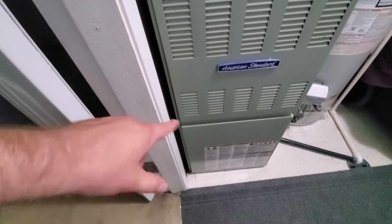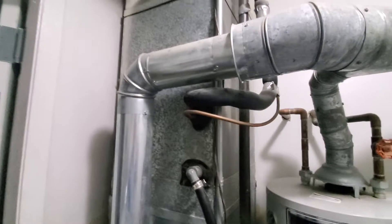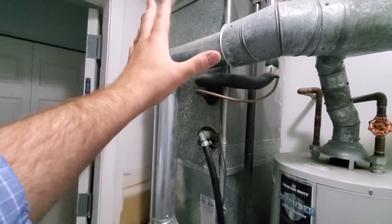We'll actually need to create a small sleeve to connect to the side of that. Over here there is no drip leg, and we do need to change the gas valve. We are putting in a large fan power — I believe that's going to have to go on the face here with the new coil lower, and that should be fine.